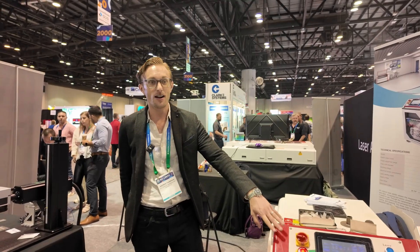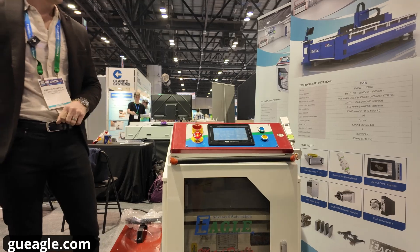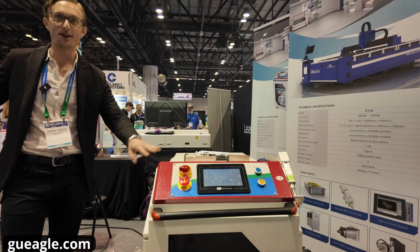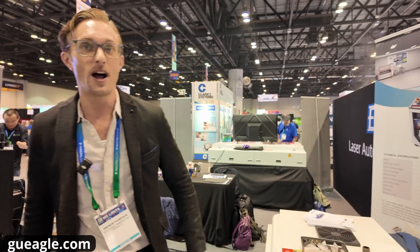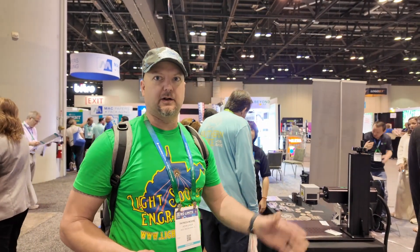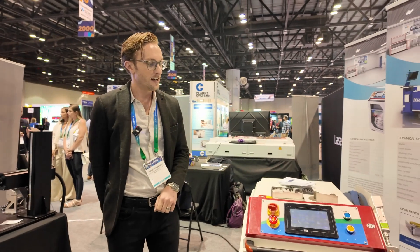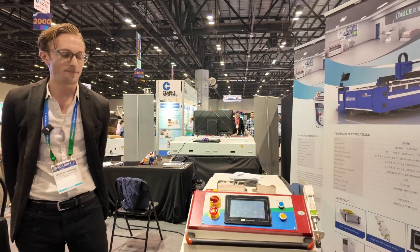This is their 1.5-kilowatt — that's 1,500-watt — laser welder, a very fun machine. They also make a similar machine up to 3,000 watts for welding. Patrick has a 2,000-watt 4-in-1 feeder welder cutter cleaner with a welding seam function. Both machines are water-cooled, with the chiller and fiber built into the chassis and an external wire feeder. It'll work on any metal.